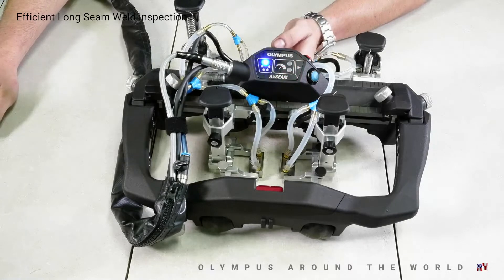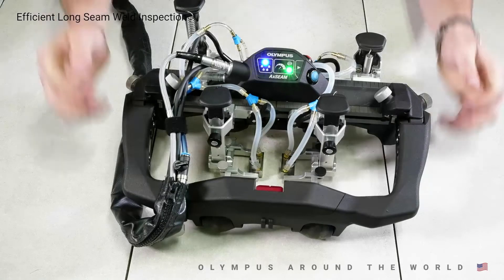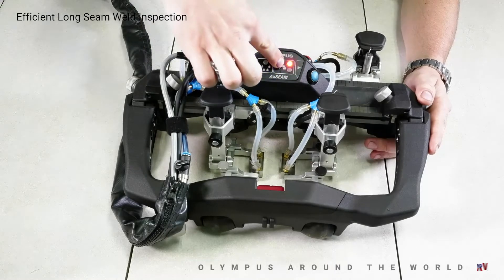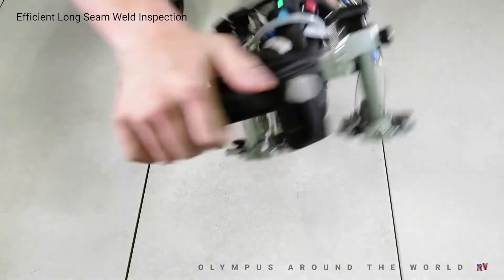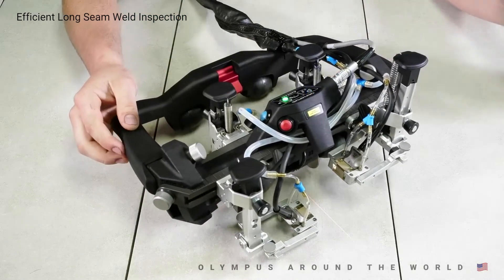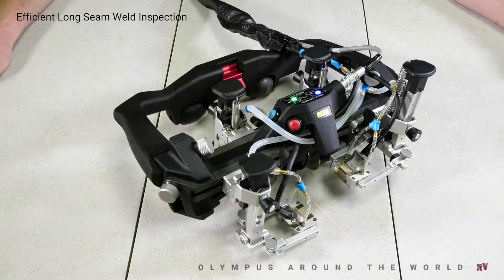Another key factor in collecting good data is missing scan lines. By exceeding the scan speed you miss data lines, and without constant monitoring of the instrument, the operator has no way of knowing. With the ScanDeck communicating directly with the X3, missing data lines is now in the past. The red blinking light indicates the scan speed has been exceeded, notifying the operator to back up and recollect that area. The ScanDeck also features a built-in laser powered through the encoder cable along with a start acquisition button, which resets the encoders once the scanner is in position and ready for inspection.